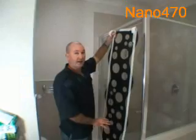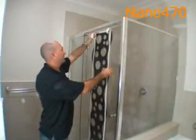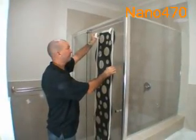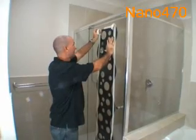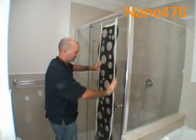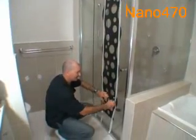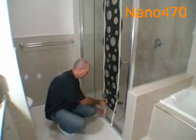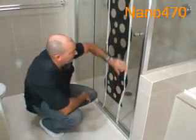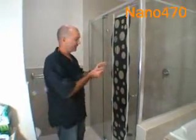This is our glass pattern, which we're going to apply on the outside of the door. So when doing that, we'll position it just using simple masking tape. Bond it into position, place into position. Now, you can use the stencil if you like, or you can creatively place the bevels in places that you want, different sizes and different areas. Okay, once that's in position, we're ready to bond our glass bevels into position.